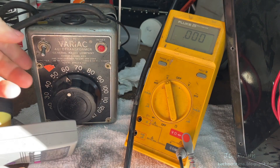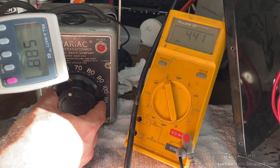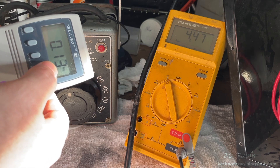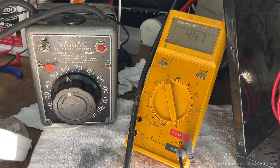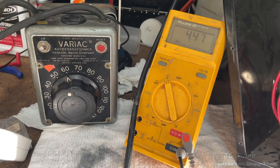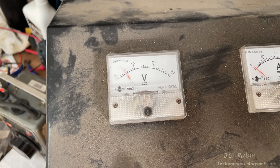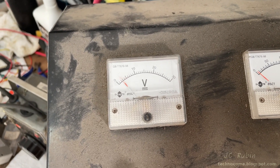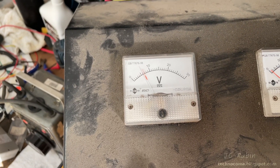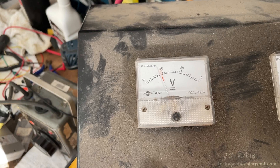I ramped it up from zero to 60 volts. Adding in the Kill-A-Watt so we can see live current: at 60 volts, we're only drawing about 130–140 milliamps on idle — definitely no problem. We're also seeing 4.5 volts DC on the output at 60 volts, which is half power on the six-volt setting, so the output voltage is correct. Rotating the selector knob through the different settings while watching the front voltmeter to confirm all taps are working: 5.31, 6.51, 8.96, 8.99 — and off.